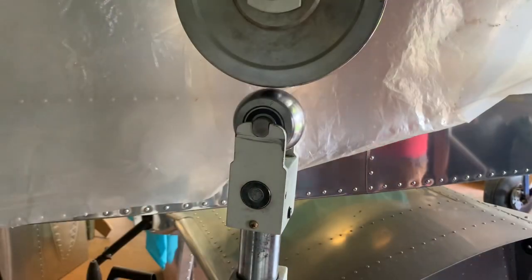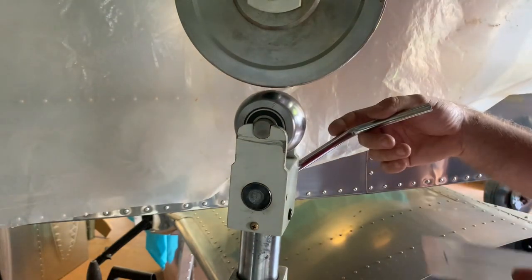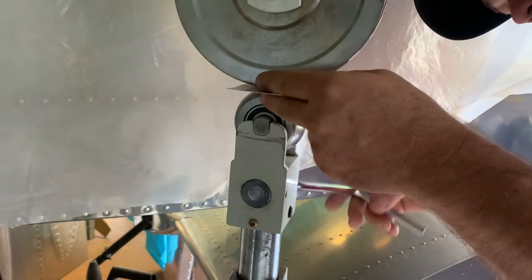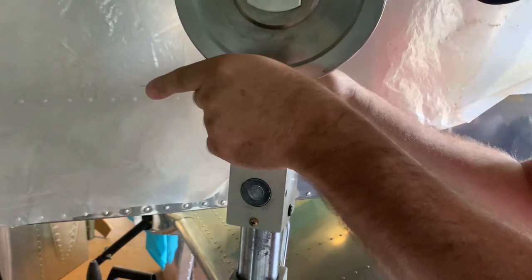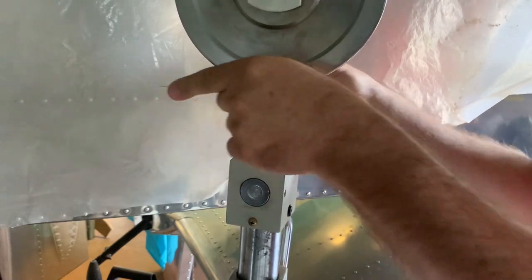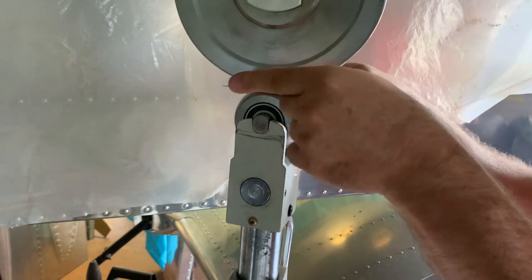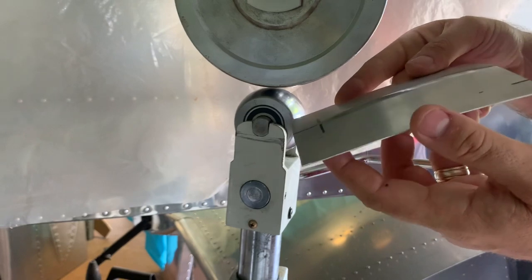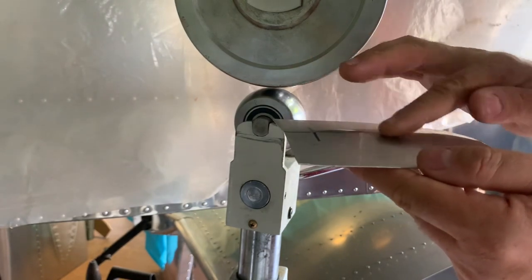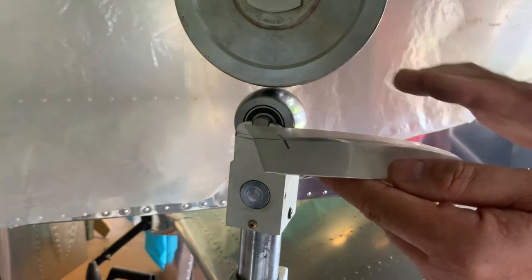We just wheel that up so it just touches for now, then we can add tension a little later. Put our piece in and we start working our way along the line - it's only just touching at the moment, just back and forth, and we'll work that up with a bit more tension. Let's just raise the center for now and then start working crossways. We've got a raise there already - I might start moving over in these areas a bit more, stretching further up here, because we'll end up with a shape like that.